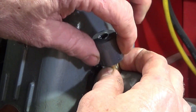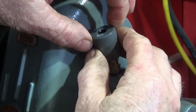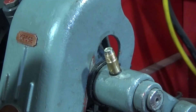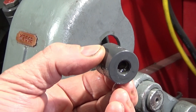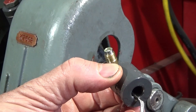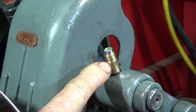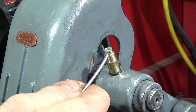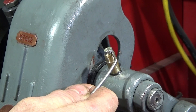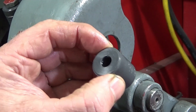I'll show you exactly what I've done with that PVC adapter. It's the 1/8th BSP thread in here and I've put a 45-degree angle on the end there, which sits on this angle here and seals there. The button oiler is in the top there and I could actually use the oil can on the button oiler as well if I wanted to, but I don't need to now.